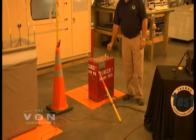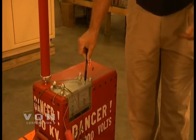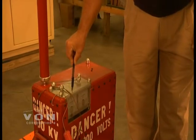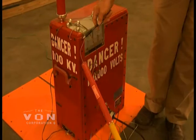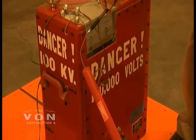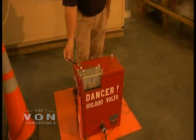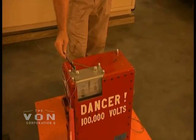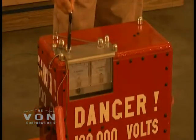This is a DC milliamp meter with a DC microamp meter. The milliamp meter ensures that you don't go too high on the unit to where you hurt the unit. But the microamp meter is for you to have your recording so that you can follow ANSI Table 2. This is a ground-resistive stick that allows you to ground the unit after you've used it without damaging the unit or without harming yourself.